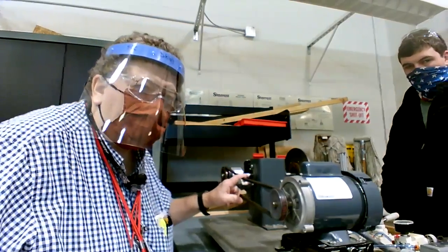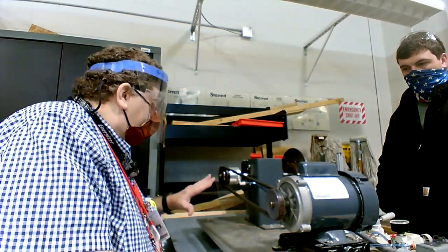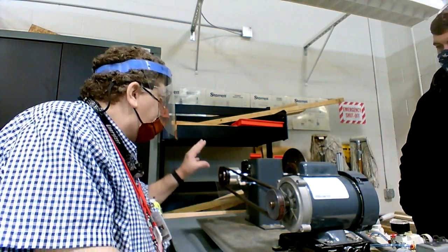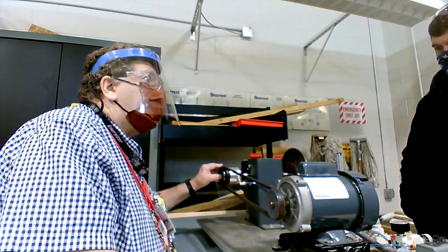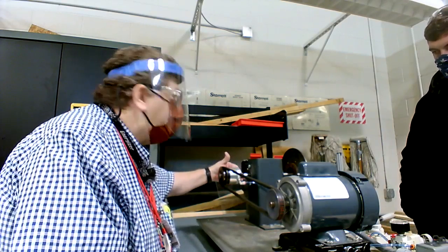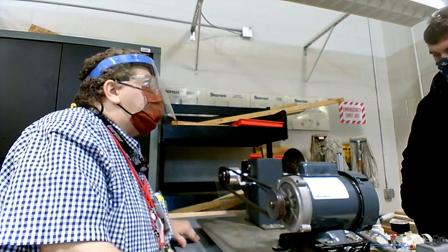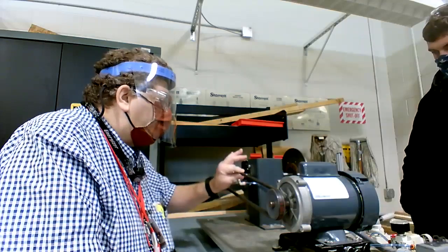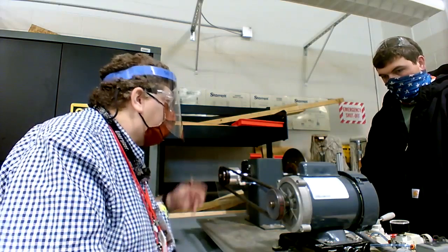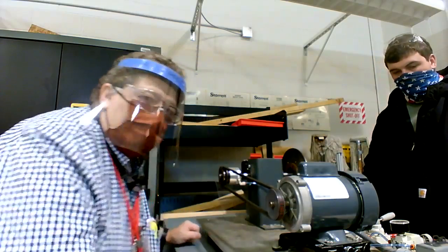Even though Gates doesn't make a tension tester, remember they said in that statement that the minimum tension on a belt, as long as it doesn't slip under full load, is okay. I'm going by how lightweight this thing looks and how small that shaft is, and we're sitting way out, so there's a lot of leverage on pulling that as far as warping or bending it. So I would actually say go as light as you can so it doesn't slip. That's subject to opinion too. I don't think I'd go any heavier than that, to tell you the truth.